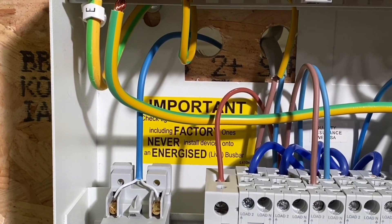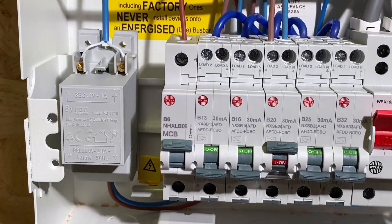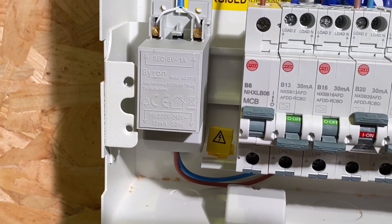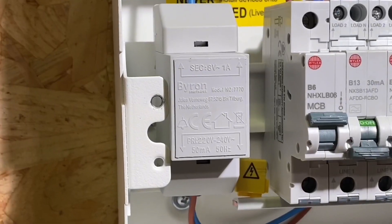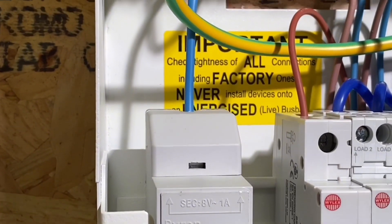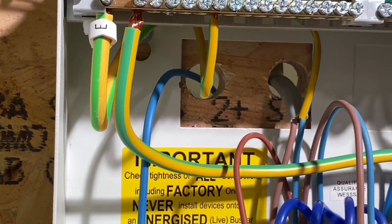When we put the cover on the top of the bell transformer, you'll see the 8 volts it's rated at on the outgoing side. We faced this problem on our smart home takeover - we fitted a smart doorbell there and they used security alarm wire for the bell circuit, which is also only rated to 50 volts, so that's something we'll look to correct.